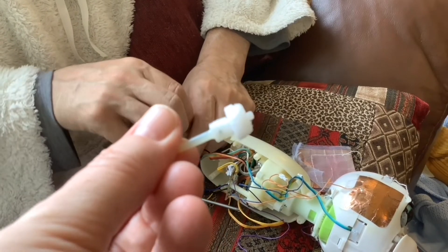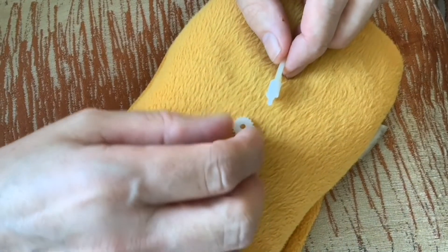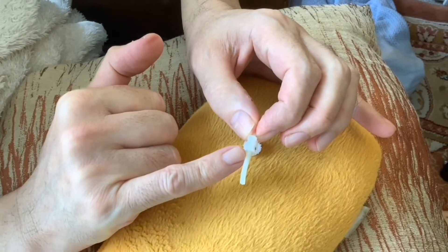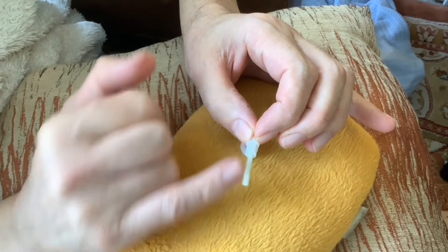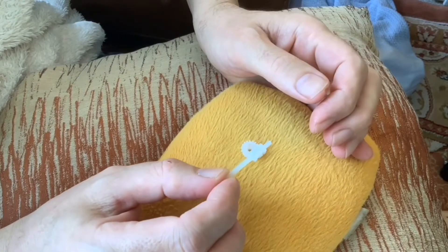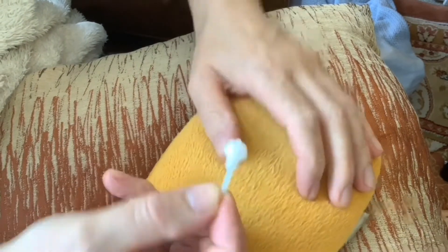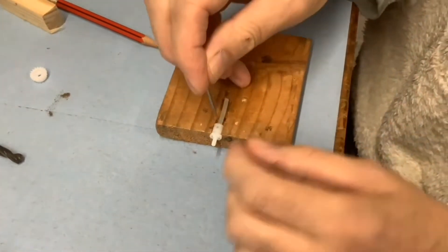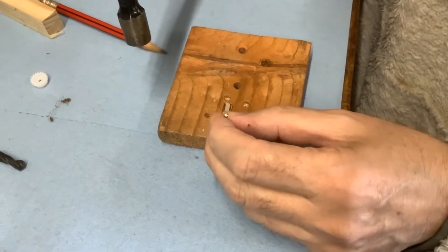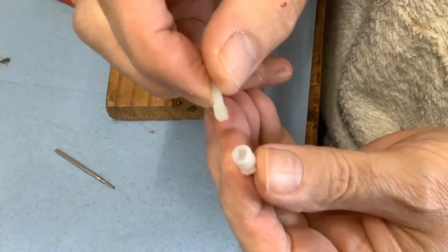What is this actually consisting of here? Well, it's got a gear and then the tail bit which it's been held by. You can see the pin that holds the tail pinned to the gear. There's a gear and a bit that plugs into it which the tail is attached to — it pulls out of the gear. We have to separate the tail from the bit that plugs into the gear. It's like a cube shape that locks into the gear like a key, so when the gear turns, the tail turns. To extract this you've got to knock the little pin out — there's a steel pin holding the tail. Using a punch and a hammer to drive that steel pin out, just tap the punch and drive the pin out, which is quite a tight fit. Once the pin's out, the tail itself will unplug, and you can see that tail has got a squared end.